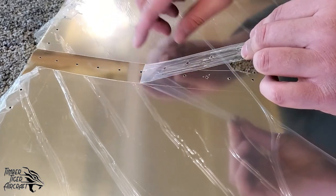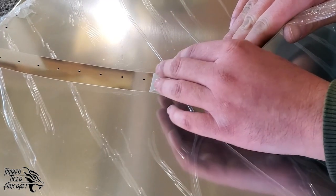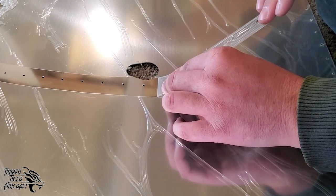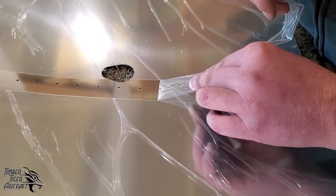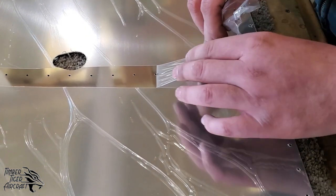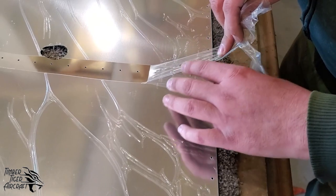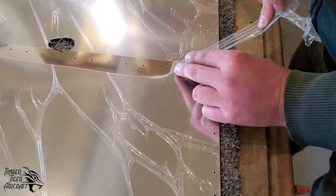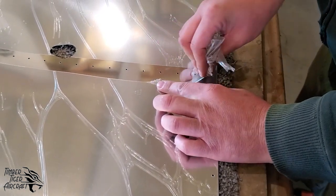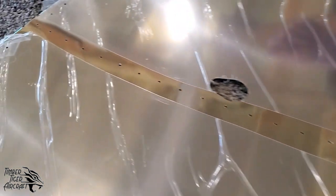And of course on the outside of the airplane, which this is, it's the exterior skin. If you did find a score line like that, you can polish it out. And our manual tells you as well what to do about dents, dings, scratches, all that kind of stuff on this airplane. Because I'm going to tell you right now, you're going to dent it somewhere. That's just all there is to it. A little tiny ding from a ratchet or something like that. Maybe you've got a couple kids and they're out playing where they shouldn't have been and dropped something on the fuselage. Don't panic. When you find a dent or a scratch in the fuselage that you had hoped to polish, look how well that worked. Don't panic.